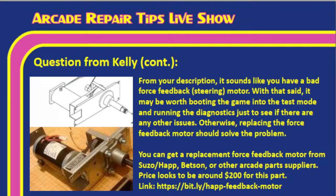You can also get used ones on eBay, Tim, and I think you mentioned that as well, and they are a little bit cheaper, but the only thing about the eBay route is you don't necessarily know if it's working, right? Right. Now Nate says that maybe with the force feedback board, if it's plugged in and forces it to go one side, it could be the same issue, Tim. The board has two OPA541AP chips. If one goes bad, it'll force itself. Have you had that happen before, Tim?